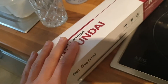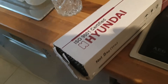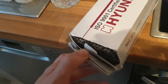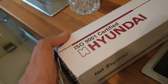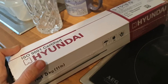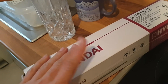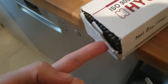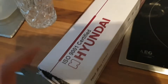They'll probably last a couple of years for me, but I still don't want them to degrade, so I've got to figure out how to store them. Of course you can use an electrode oven for storing, but most hobby users don't have one. Since this box is open there's no way to close it again, so I want to show you how I do this.